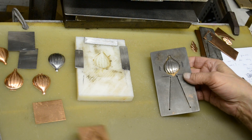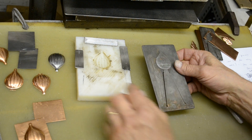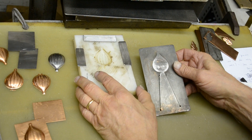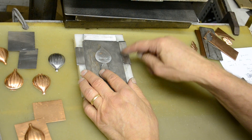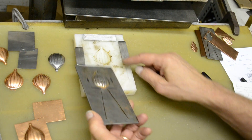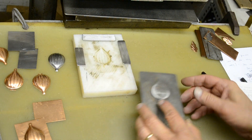The reasons for doing it that way are because it's going to be less wear on the nylon block, less stress on the die, and also better alignment so that the die doesn't run into these stops and mangle them, and less damage to this nylon mold as the metal's being formed against it.